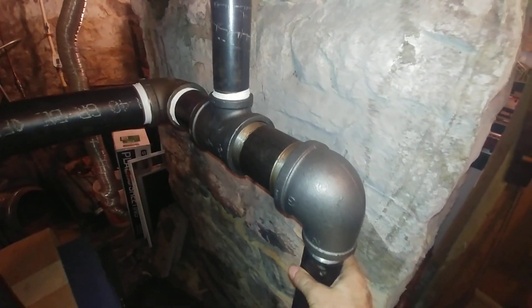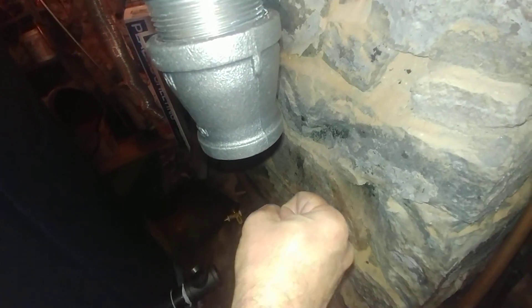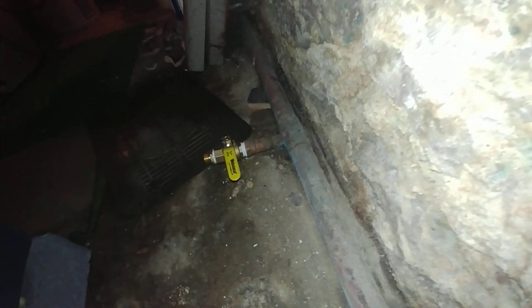This still hasn't been made up yet. I'm dropping with two-inch to about there, then transitioning to inch-and-a-half just above where the Hartford loop is going to be tied in right about where my fist is. Then we're going into that two-by-inch-and-a-half T with a drain there at the end, with some nineties to make that up with the equalizer line. There is the existing wet return, and we've removed the drain valve and installed a full port Webstone ball valve for better drainage.